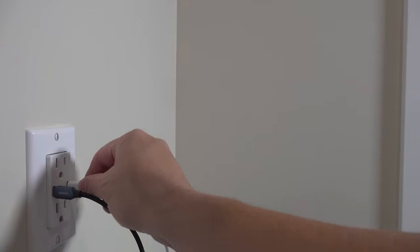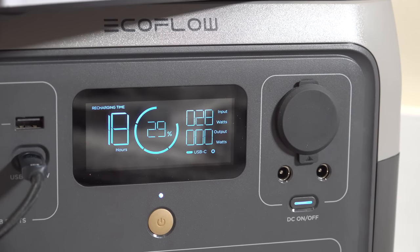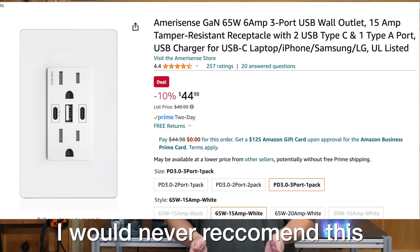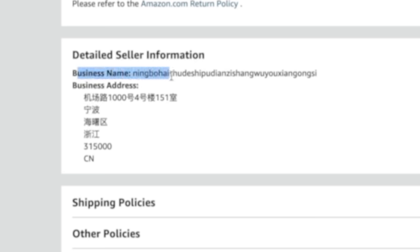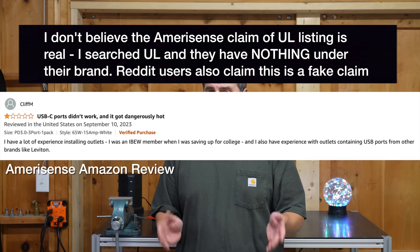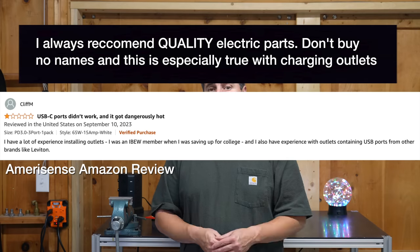You need to be aware that you can't get 60 watts out of both ports simultaneously. When you have two devices it's typically going to lower the output to 30 watts on each port. Now there were two other models I found on Amazon before ordering this and they are less expensive. This Leviton model is just under $80. The other model that's been on Amazon is made by a company called AmeriSense US — the company name they have listed I can't even pronounce. No one really cares about electric safety until your house burns down or you have something overheat. Get one of these Leviton outlets that's fully rated for 60 watts and is totally safe and tested. If you don't want to spend that much money, don't get a cheaper version of this outlet — I would recommend just getting a standalone charger.